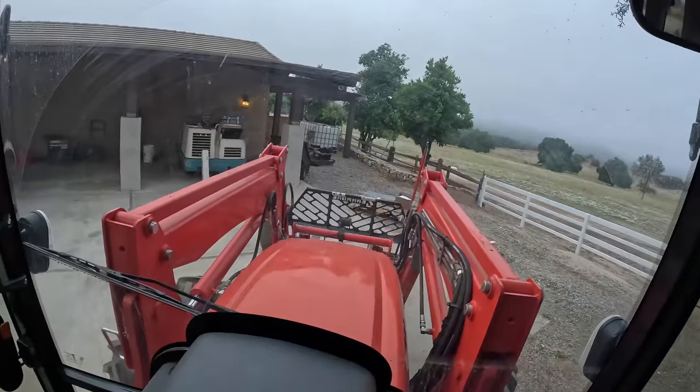Now, this morning we still need to install the roof purlins before we can actually get the roof panels on. This is a very crucial part, because this is when we lock all of those wall panels in plumb. So we have to take our time here and do it right. I'm going to pick up the pallet with the purlins on it. We'll take it over there and start figuring, because this also determines our gable overhang.